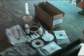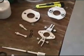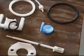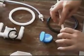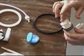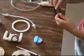Before assembling the Gator, apply silicone lubricant to the sealing O-rings and their sealing surfaces. First, apply silicone lubricant to the two O-rings on the motor pump connector stem. Next, apply silicone to the bore at the top of the pump body and the pump body O-rings. Then apply silicone to the O-ring seals for the motor caps and the motor cylinder.